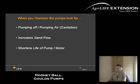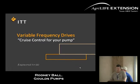Slow it down, pull it back a little bit, because one thing you're doing is increasing the possibility of introducing sand into your well, because you're putting more stress on the well to introduce sand or bring something in, or even to pump off. And when you do that, you put stress not only on your motor, but on your pump and your well as a whole.